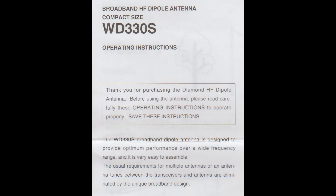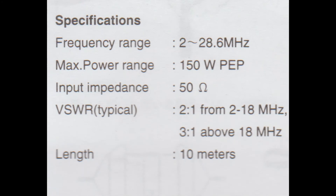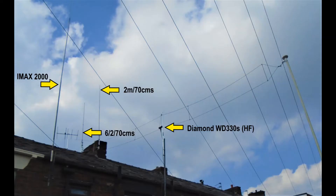The following footage indicates that the 10 meter and 12 meter bands show excessively high SWR readings, and I suspect that this is purely down to the built environment and the way in which I have installed and configured the antenna. I think that I am getting some reflective power coming back from the roof of the dwelling.